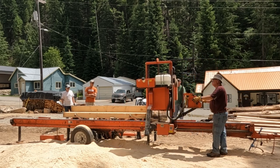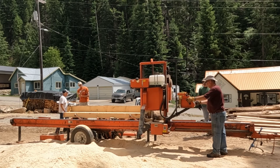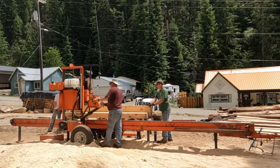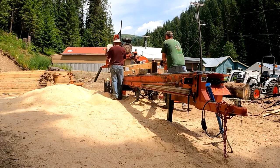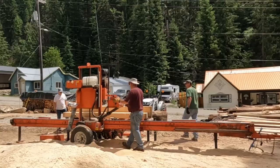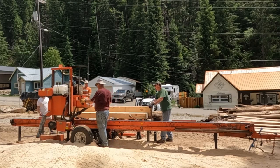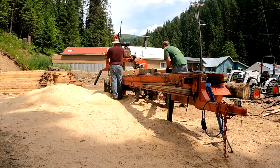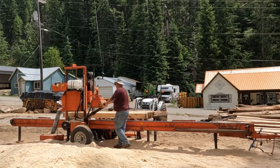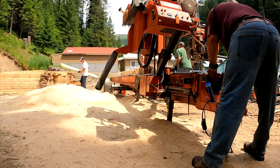One thing about milling slabs is you always have to watch when you get out near the end because they tend to fall off on both sides — and they can fall off and get in the way of the mill when you try to draw it back, so just pay attention. Since I'd already flattened the other side, I flatten the top at 12⅛ inches, then drop the head to 6 inches, mill them right in half, and that gives you a bunch of 1x6s. Once those are done, all we've got to do is get the cants positioned to knock them all the way down.